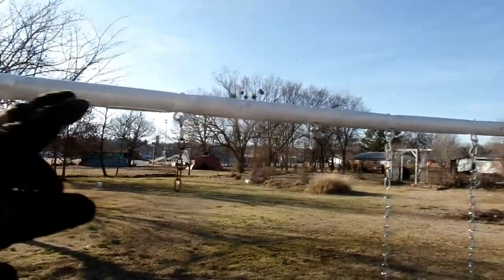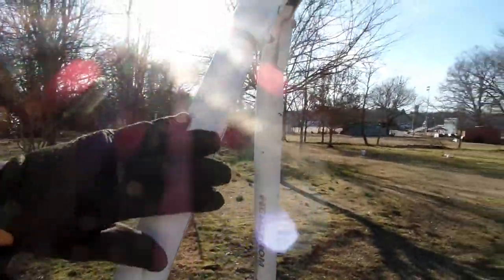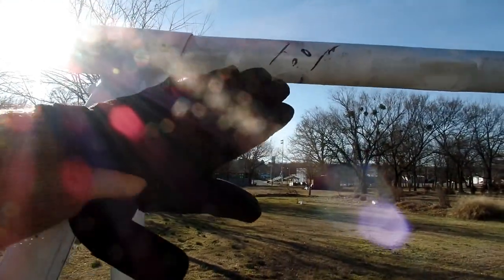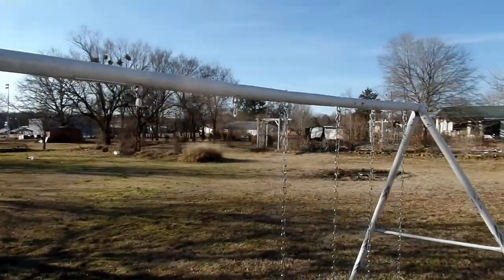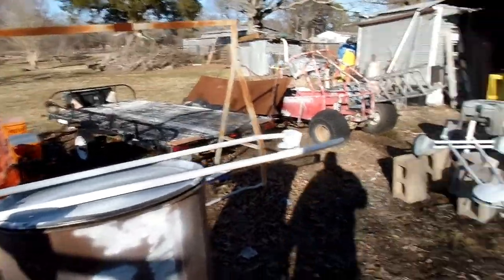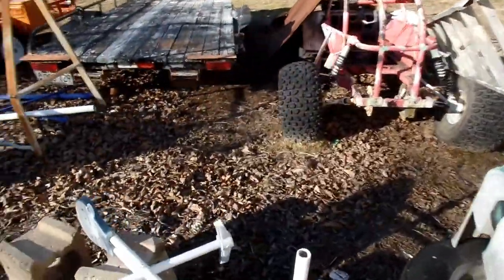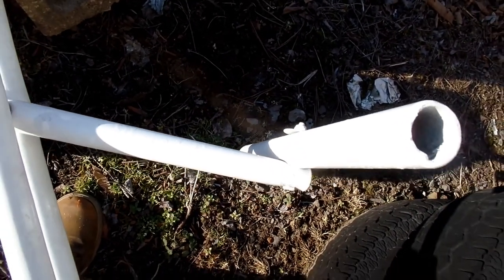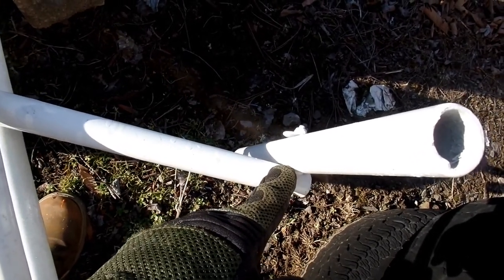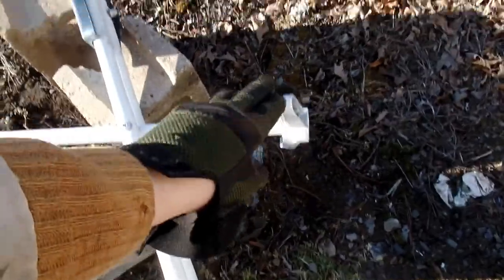The paint is cheap spray paint — it makes it look better and hopefully makes it last longer. This little brace system, once I get it set up, should be really good and sturdy and safe. I just got through painting that one — it's good and heavy duty. It was missing the bottom piece, so I took some tubing and drilled it with a 7/16 bolt, two inches long with a nylock washer. I put a cope — a half moon — in that so it stays put against the tubing and won't turn. That's going to outlast the plastic piece.